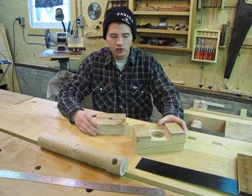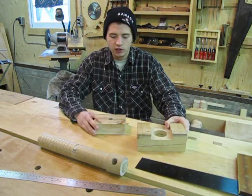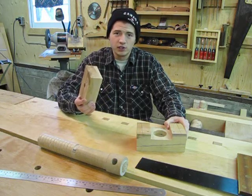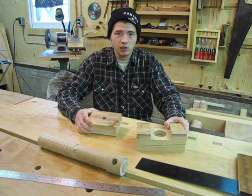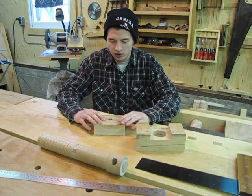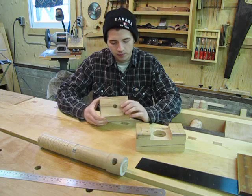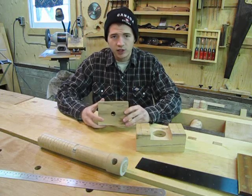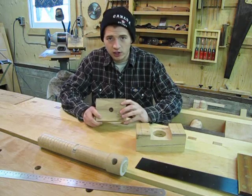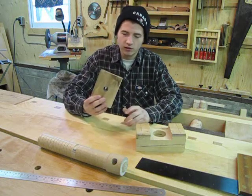I'll be making a guide which is a slight modification to this one. In that case you only need a piece of stock which is about two inches thick, though going any thicker is perfectly fine as well. After you get your material, you can drill the internal diameter of your screw into the guide. I'll be making one inch diameter screws with four teeth per inch, so the internal diameter of my screw is three quarters of an inch — that is the size of the hole I have drilled in here.